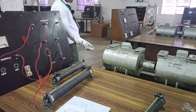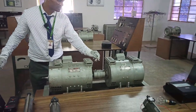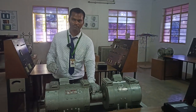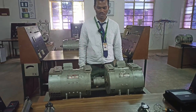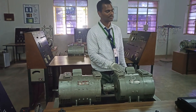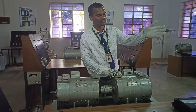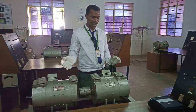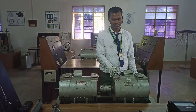This DC motor has two parts: one is the stator part and the other is the rotor part. The stator is made up of field winding and the rotor is made up of armature winding. In the case of an alternator, it is the reverse of a DC motor — the rotor is made up of field winding and the stator is made up of armature winding. Automatically an EMF will be produced in the armature, available across R, Y, B of the alternator. This explains how to use a permanent magnet synchronous motor or an alternator in electric vehicle applications.